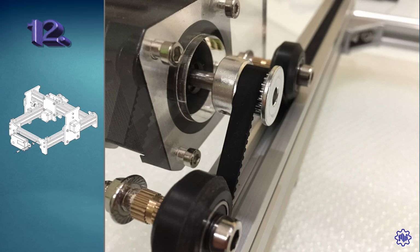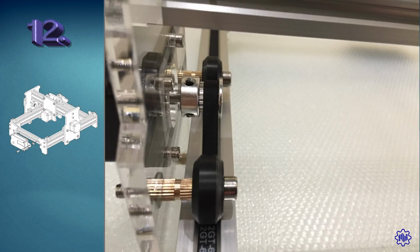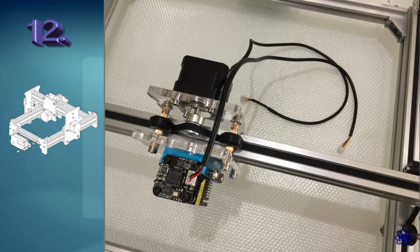Now, align the 3 toothed pulleys, and finally we can tighten them definitively. With the mechanical part we ended here, let's get the wiring now. First we identify the only 3-wire cable. We will place it from one end directly to the laser electronics board at the right connector.